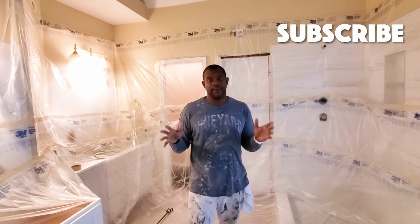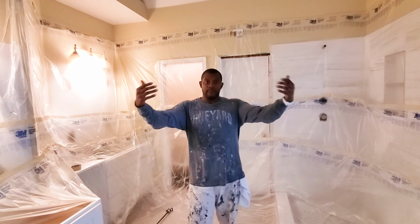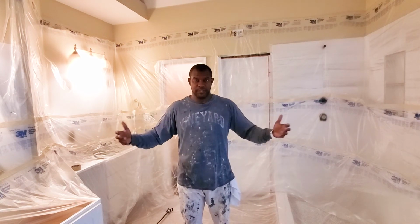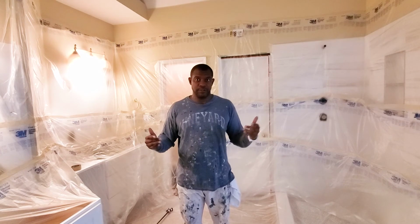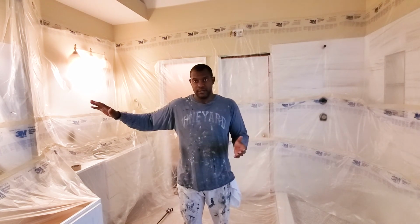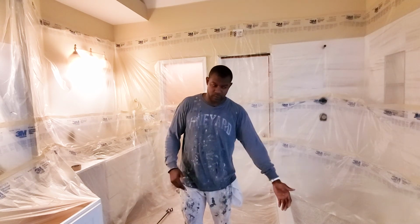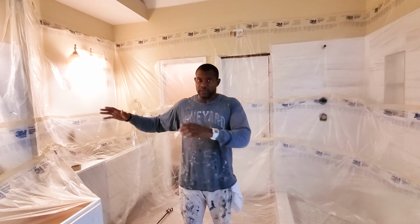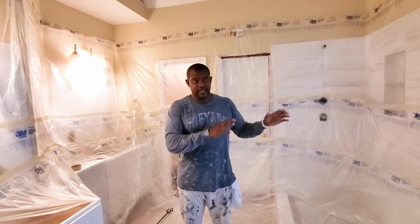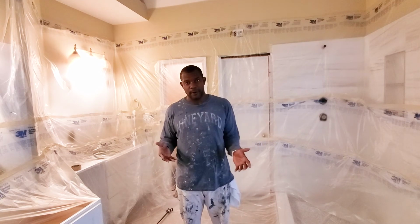So you don't want that to happen, and one of the best ways to do that is by keeping your momentum going and keeping your flow moving forward. Once you start painting, you'll get to painting soon enough, and you want to be in a position where you don't have to double back and do things twice, because that's when you start to try and cut corners and you end up leaving material in the paint tray too long. You end up leaving your roller over here and it's drying out. You leave paint in the sprayer for an extended period of time because you're trying to go back and pick up prep work again, prep work part 2, when there should have only been a part 1.